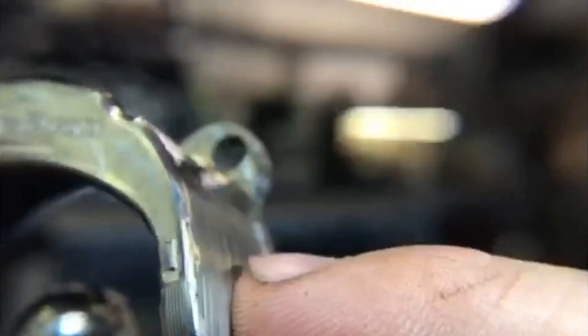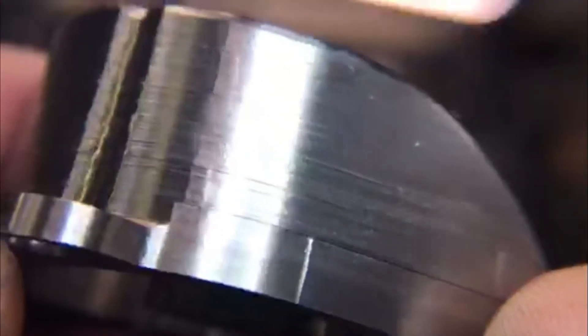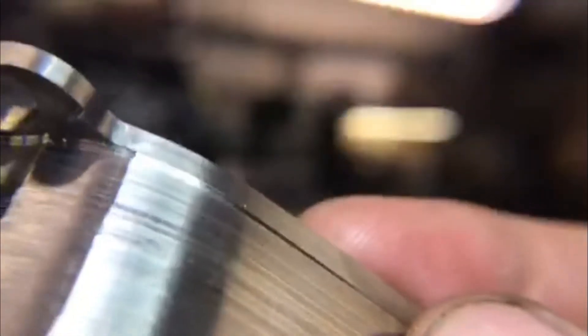This is completely off the machine, I have not touched it one bit, so you guys can see all the flaws in it. It left a little piece right there — I don't know why — it did not do it on that side. I increased the step over and it's smooth as glass, but I got a little lip and the surface finish did not come out good. I thought it was a new tool but it was an old one. I also got a little lip there from flipping the part, which is why I created the fixture so I don't have to flip the part — there will not be any lip, as it contours from this side all the way around.